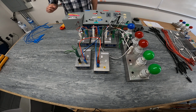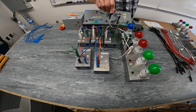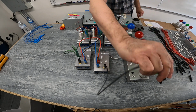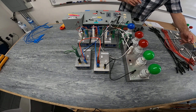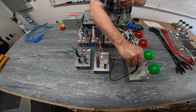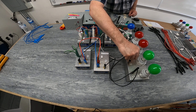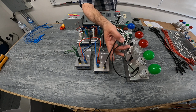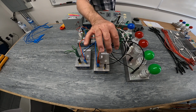Okay, then we will connect from our second three-way switch and connect to each one of our lights from the common terminal of our three-way switch. We will connect to each one of our two lights that we want to energize simultaneously. And again, this would represent our switch leg. This common of our three-way here is now a switch leg to both of our green lights. That is my switch leg.